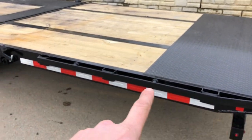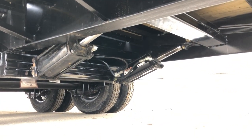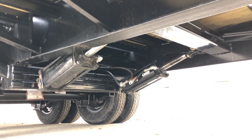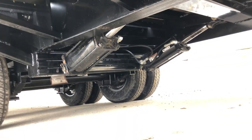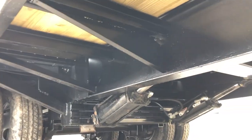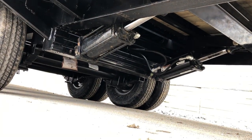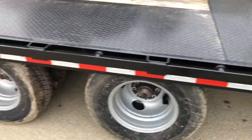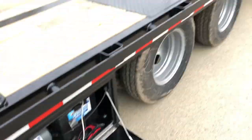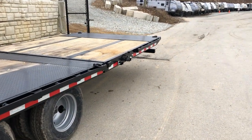The tail's also got your rub rail and your tie downs all the way back. To undo the tail — I've already got it open here for you — it's a simple pin setup. A couple of nice things on ShoreTrak's tail: these are dual 5 inch cylinders. A lot in the industry are going to do 3 inch; occasionally I've seen 4 inch. ShoreTrak's the only one I've seen with 5-inch. Then they do a triple stack of 2 by 6 tube that the tail is supported by, and you'll notice the pierced gusset's still coming all the way back. So they've got an oversized cylinder and a little bit better bulkhead than what we've oftentimes seen back here. Got a heavy-duty hinge point on these, so this tail will swing up past level just a little bit.